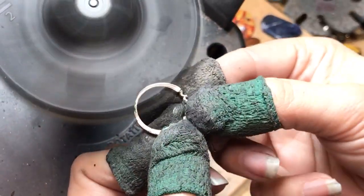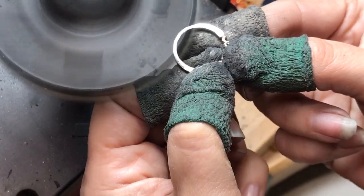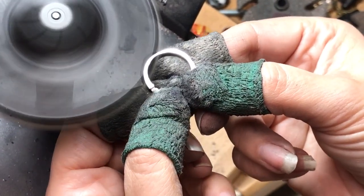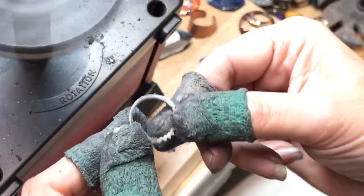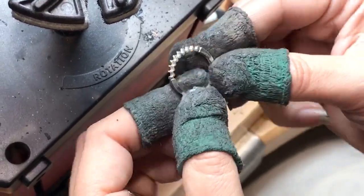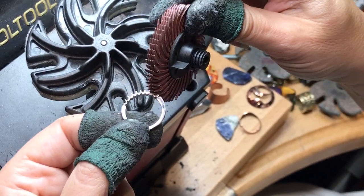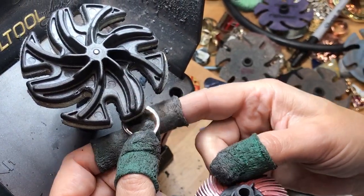The person working on the bench doesn't have to destroy it, eat it up with so much emery paper. It didn't go through an abusive process. It didn't even go through an ultrasonic cleaner at this stage, because between compounds you have to stop and clean them. Already we're polished. To get in there I would use these brushes — we even have smaller three-quarter-inch ones to get in. These are pretty good. Even the side could be totally polished, perfectly flat.